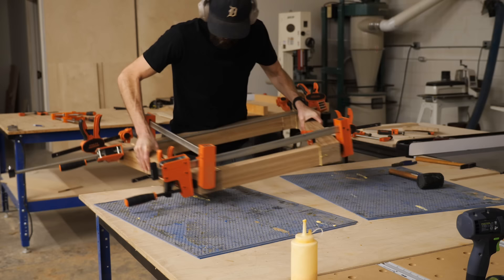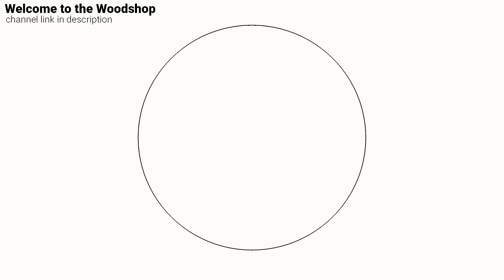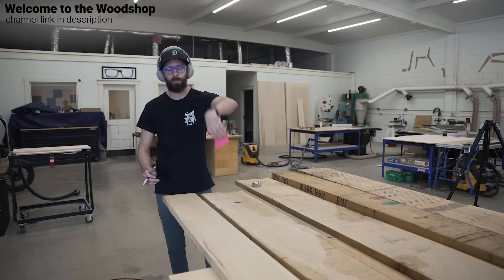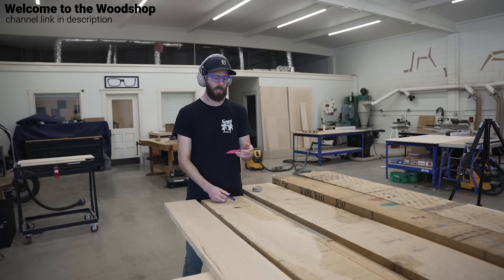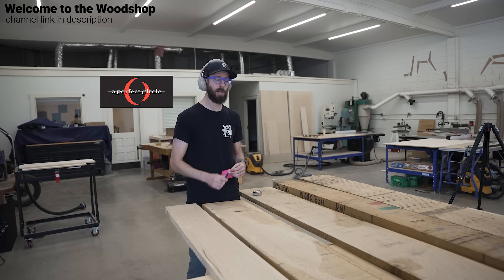The first thing we're going to do is start cutting boards into chunks to make our 48-inch circular round tabletop. In the center you need boards longer than 48 inches, obviously. But you don't want to build a 48 by 48 square and then cut a circle because that's wasteful. You can stair-step it so boards get shorter as you go toward the sides — so you go 50-50-50, 46 inches on the next ones, then 38 inches on the very end pieces, and it's a perfect circle. I can't think of any A Perfect Circle songs to make a pun, but I will say that in order to make it, I'm going to use my tools.